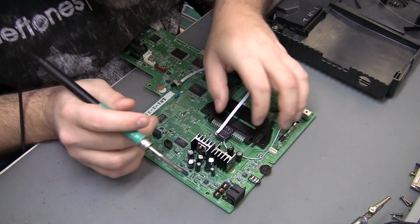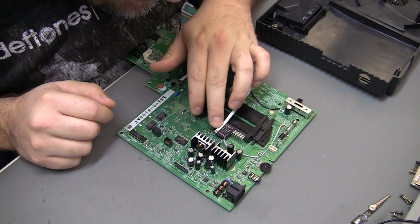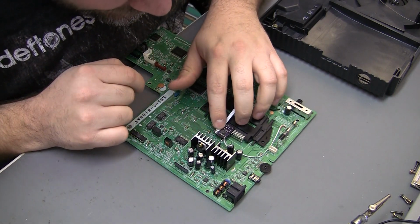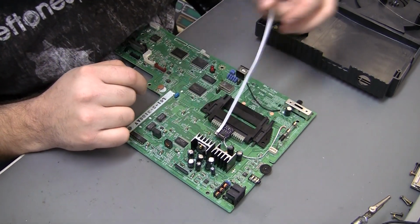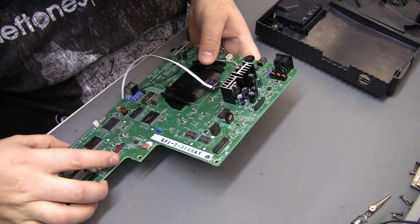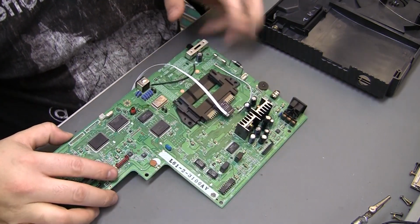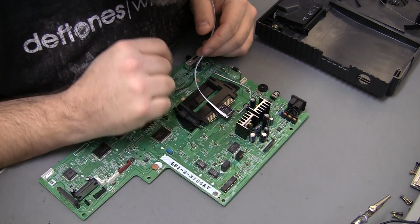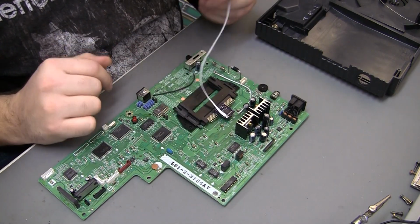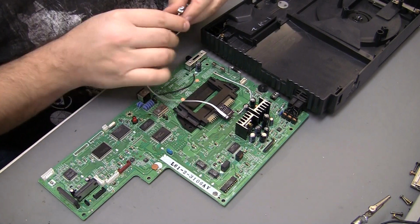I think I need to increase the size of those pads and maybe spread them out, or maybe thin them up and elongate them. That might be best. I mean, that was okay, but for public use, for somebody that's not got the best soldering setup or whatever, I might make those a little bit bigger on the redesign. I only had 3 made just because I knew I was going to find some things I wanted to redo about it. I'll also probably add a 0.1 microfarad cap right to the PCB, kind of a bodge on.